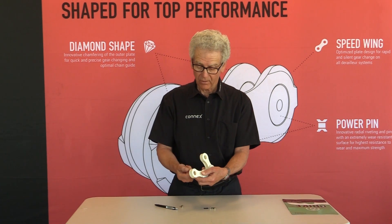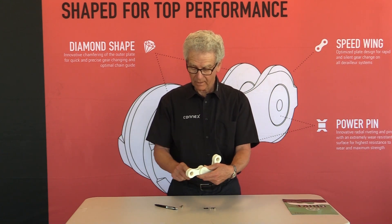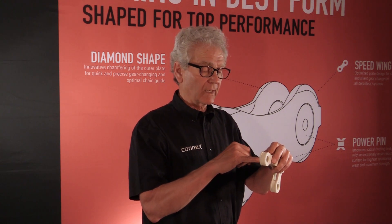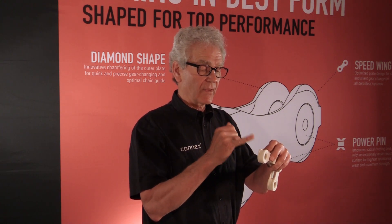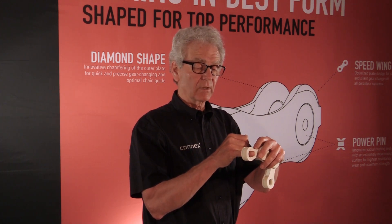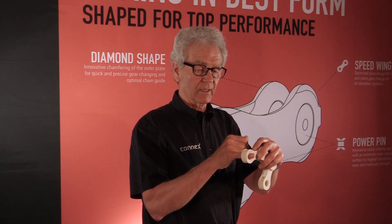The bearing parts are the inner link and the pin that goes inside it. As the pin begins to wear and as the collar begins to wear, the pin gets thinner and the space that it's going through gets longer, with the result that the chain elongates, because each link can move like this.